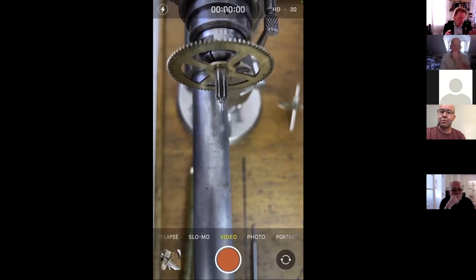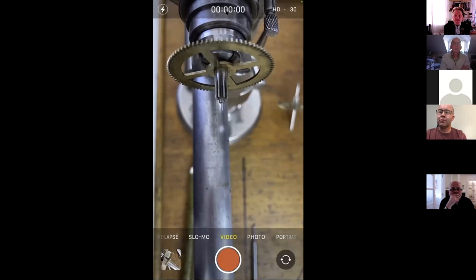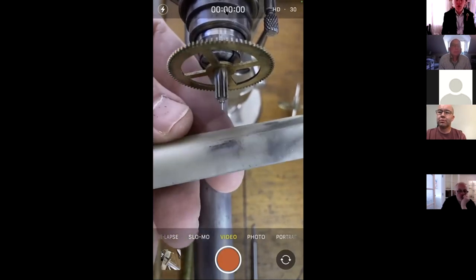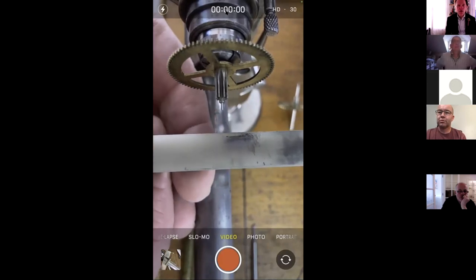And then to put the final finish on the pivot, you can see here, I'm not messing about this week with a close-up camera because it's such a faff. We can always look back at last week. I'm quite happy with that finish. And that finish I made with, I tried three things. I tried first good old Arkansas stone. We talked about abrasive stones a few weeks ago. So this is what I tried for finishing the pivot. And it worked really well.